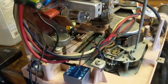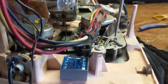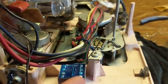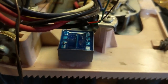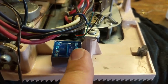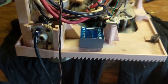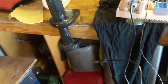I've installed the remainder of the new capacitors and cleaned up the tubes. Now I'm going to add the audio input feature. I'm running a line in through the old RCA jack, and that goes through here and attaches to what I call an isolation transformer — basically a wall wart. On the primary side, which is the two pins furthest separated, that's where 110 goes in, and then the secondary puts out 12 volts. Your incoming line goes in through the secondary, and that will guard the user from potentially getting any kind of current through the end of this 3.5 millimeter jack cord.